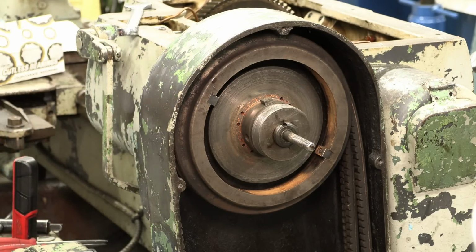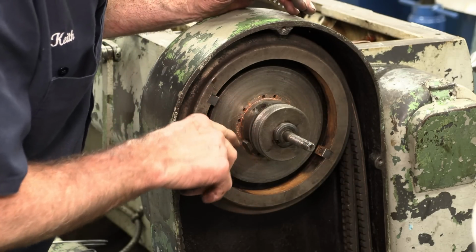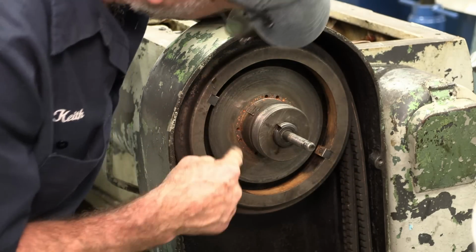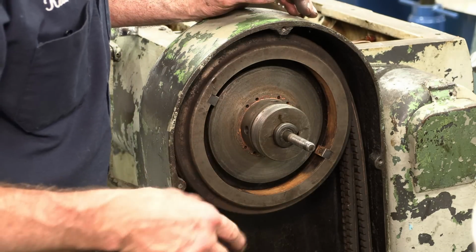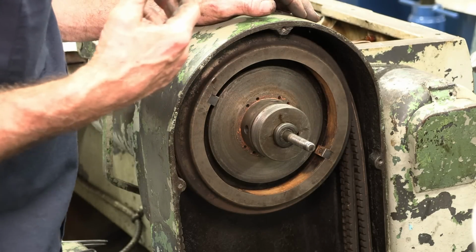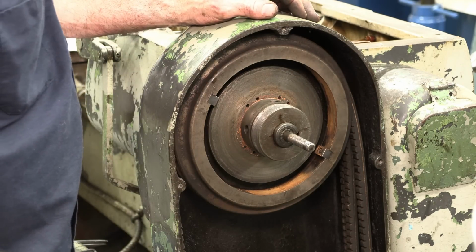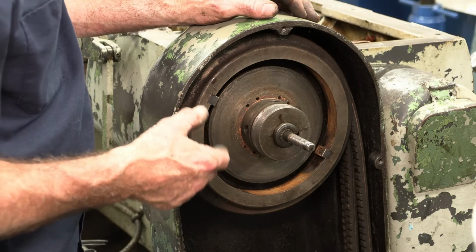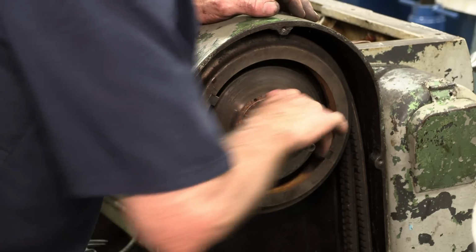And the other thing, okay, we're gonna get this off so we can look at it here, but there's a lot of damage there. This diameter here, this is where the springs are held in, and actually there was only four, and it looks like there's enough for eight. Okay, so it was under spring packed. We increase or triple the speed on here. We need to have things right up to snuff. Okay, so we're gonna have to deal with what we need to change.